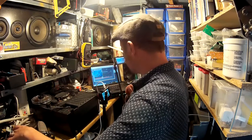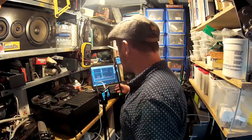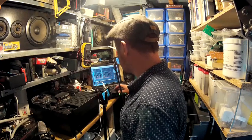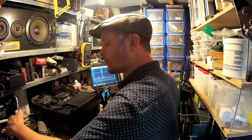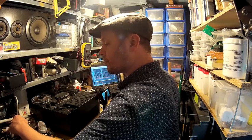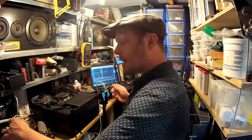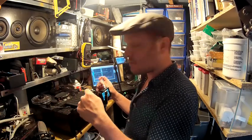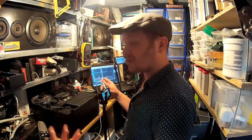I'm going to start recording. On the machine here you can see track four. I'm going to unready tracks three, seven, and eight so I've just got one track showing. Now I've got track four going in at minus 5.5 dB. Here is my demagnetized screwdriver. I'm going to press record. The trouble is you can't check the record level until you play it back — that is the disadvantage of a machine like this where you've only got one head that deals with both record and play. These are a bit more expensive to line up because it takes two or three times as long.